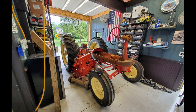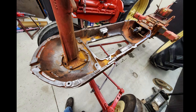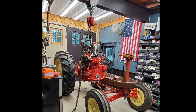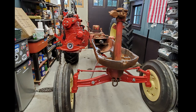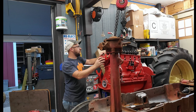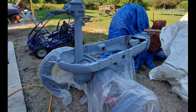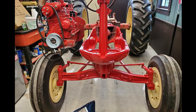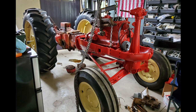The next big piece of planning was setting the engine. The engine had actually been finished the previous winter and was carefully packaged on a rolling pallet just waiting for this day. With the tractor in the shop under the overhead, I could easily roll the engine in place next to the frame, pick it, and move it into final position. I did a dry run choreography to make sure this would go off without a hitch. So the tractor was rolled out the next day, bagged to block any overspray, and the front half of the frame was primed and painted. Once the paint cured, it was literally minutes to roll it in place and set the engine — another huge milestone.